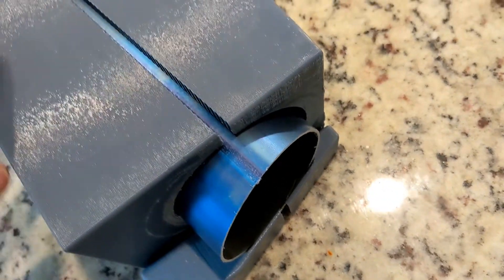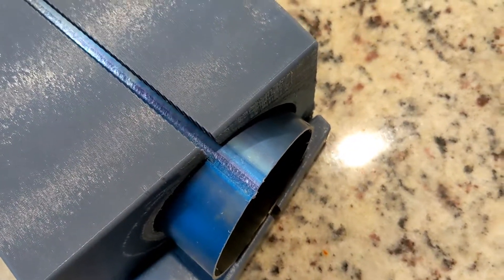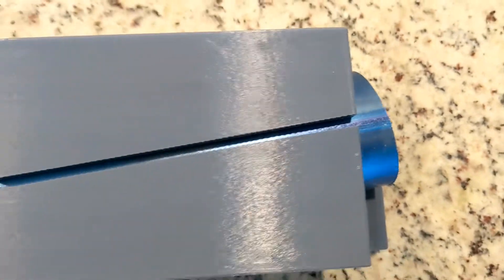Here's the backstop right there. I have this one printed out for a three inch center line radius on a 15 degree bend, so that means each cut is seven and a half degrees. As you see it's all perfectly squared up to the blade — you don't even need to adjust your band saw at all.